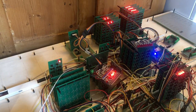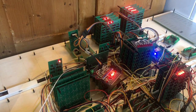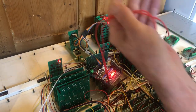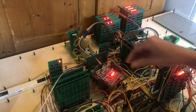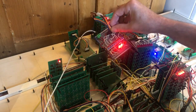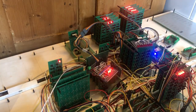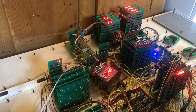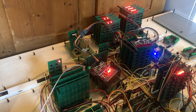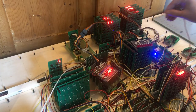So for demonstration purposes, I disabled the control part of this computer. Instead, I'm going to hardwire. I have 2 wires here, which are both positive, and I attached to the bus a machine that helps me to input a value. It's now set at 12, I believe. So what I'm going to do is press A in and hope that the register selects that value, 12.